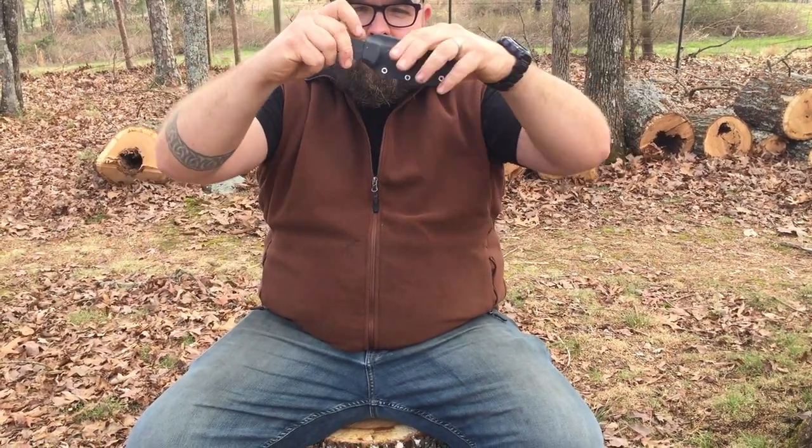You can go to Bass Pro Shop and get a really cheap holster — Redhead brand, like $6 or $7. You can pop those in the oven at 200 degrees, stick the knife in, and mold it around to fit. I sold 30 to 40 knives using those sheaths. If anybody has any questions or wants to get into knife making, just comment below. We're helpful people — nice, helpful, sharp-thing-making people.